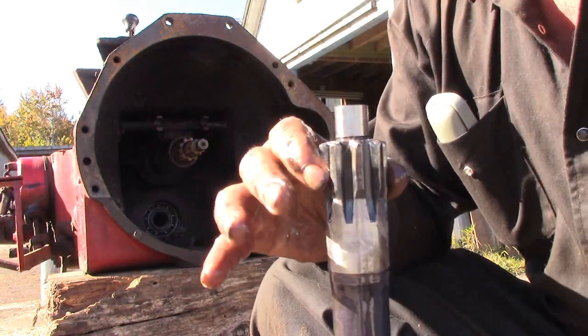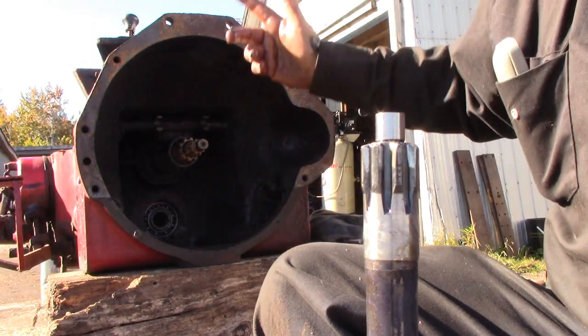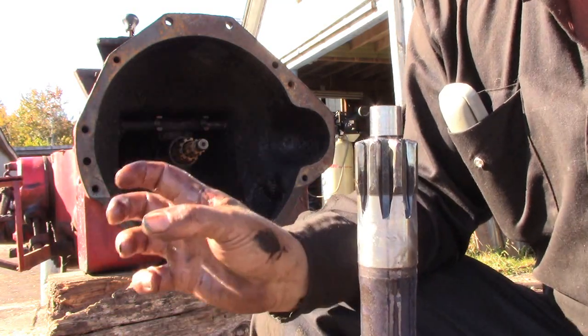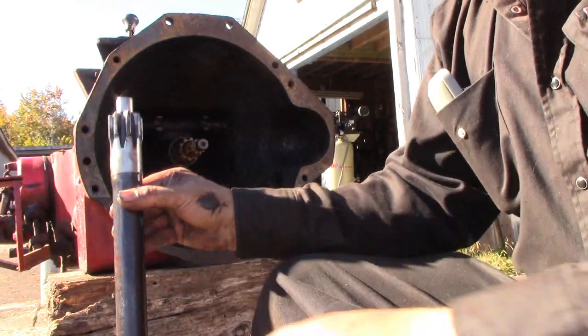So get yourself a good replacement shaft, feed it in through the back, put your washers and lock ring or nut back on, the plug goes back in, and you feed the other PTO shaft in from the back again with the collar on it. The tricky part is getting the PTO lever to engage with the collar again, but that is it — it's a pretty straightforward fix to repair the PTO shaft on these tractors. Please like, subscribe, and share, and if you have any questions or comments you can leave those in the comment section down below. As always, have a great day.